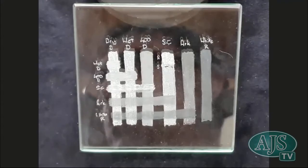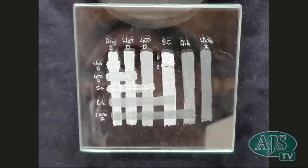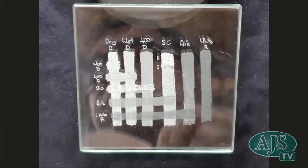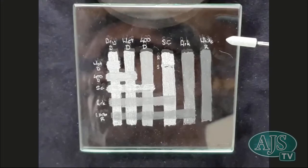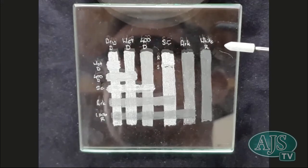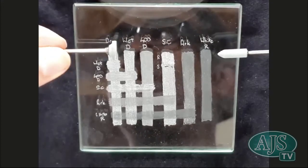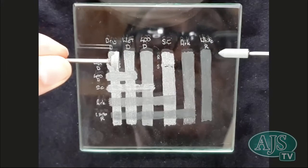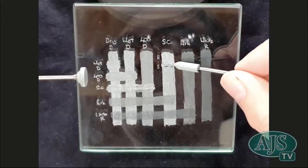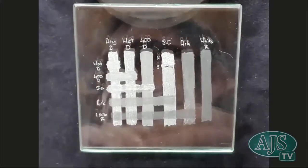I use these as the base for the engravings we do today, my mid-tone that I then work with. You've got to be a little bit selective with these, depending on which ones you buy. If you go to the hardware shop and buy Dremel accessories, for example, you'll end up with a rougher version. These are great for grinding away at metal and things like that, but less good in certain circumstances. So the top part of this section here was with one of the rougher ones. You can see it's brighter and a lot more chippy, and then we get the nice smoother graduation with the more finessed version of the stone.